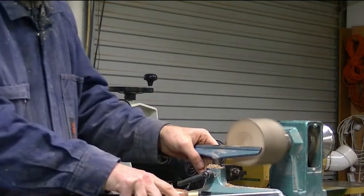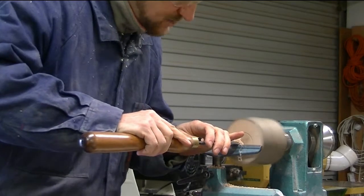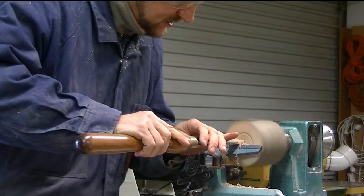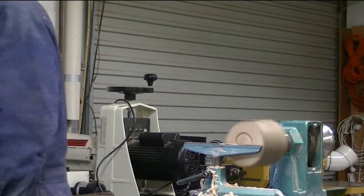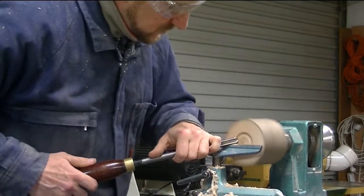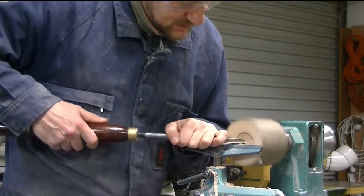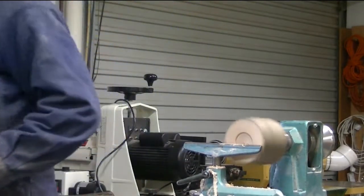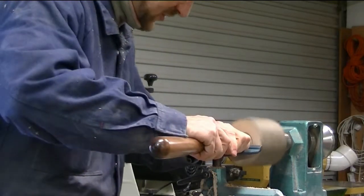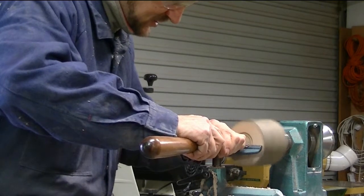So I would start this just by going pretty much parallel to the grain, parallel to the direction of the lathe, the axis. Don't want to take a lot off there. That's a skew chisel, is it? Yep, that's a standard skew chisel. And I use this to cut the bulk out of there, so that gives it a nicer cut. Goes a bit quicker than trying to scrape the whole thing out, but then I'll finish that off with the skew chisel. Just bring it gradually along, pretty much horizontal,